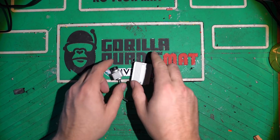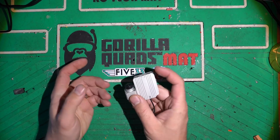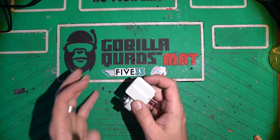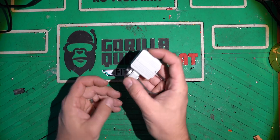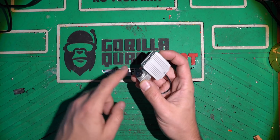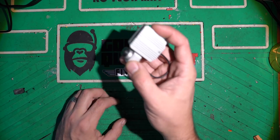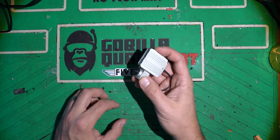That's a feature we've really been wanting from the air unit, because these are such great devices for filming. But when you're on set working with a director, you can't always hand them a set of goggles. They want to take that HDMI input and pipe it into their system — usually called Video Village — and then transmit that feed somewhere else. With the ability to output an HDMI feed, we now have full digital HDMI 720p broadcast-grade live streaming capability from any drone hooked up to the DJI goggles.